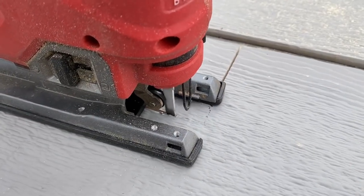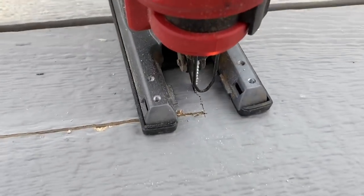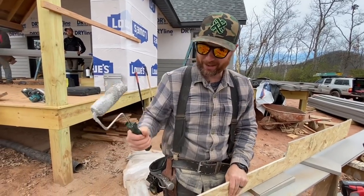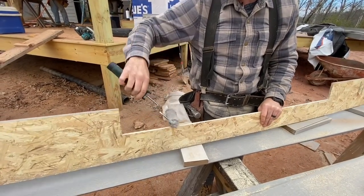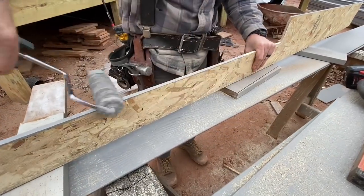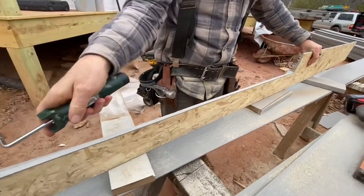My cameraman had to step away briefly but came back. To finish this cut, I'm going to take a jigsaw and take these cuts all the way to the corner in both directions. Also, on any rips or cuts on smart siding, go ahead and prime all your cuts — really nice like that — so they can't take on any moisture and swell. This stuff will last like 100 years. There we go, got that primed before we put it in.